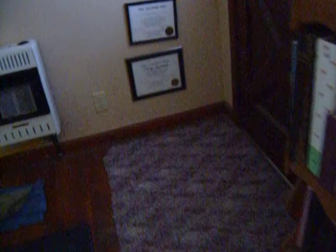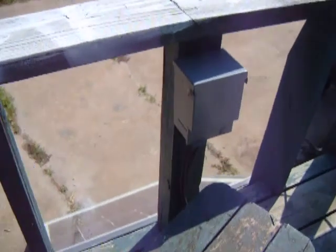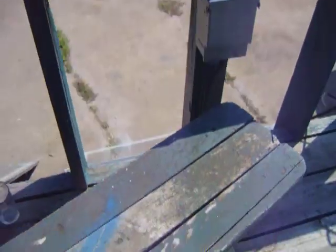If you have a charge controller, you need a breaker between the batteries and an inverter. I'm going to take you outside and show you the rest of the panels. It's only making about five amps right now. There's a little cutoff box. I have cable but it's not fine stranded — I recommend fine stranded because it carries more current. It's THHN cable.